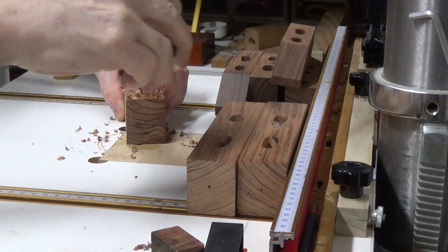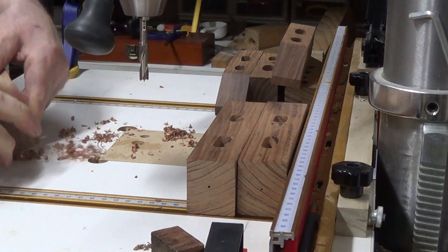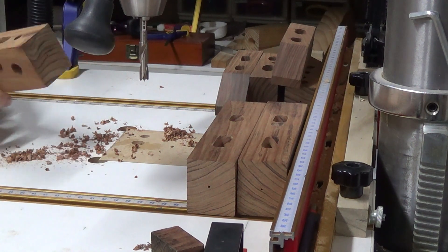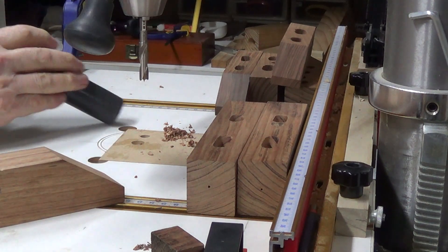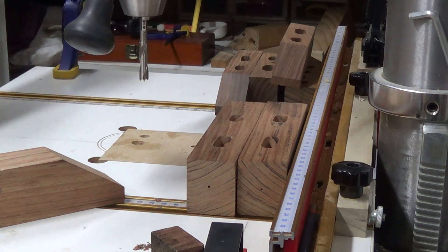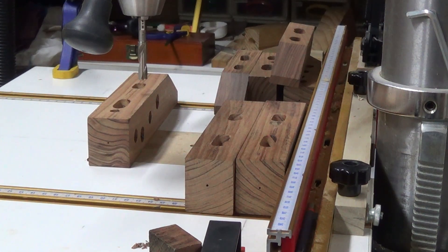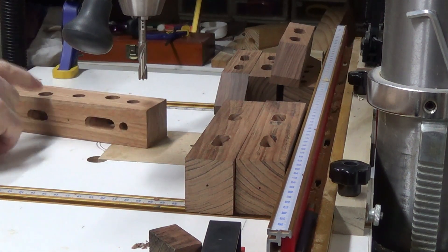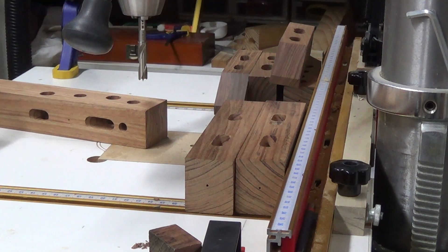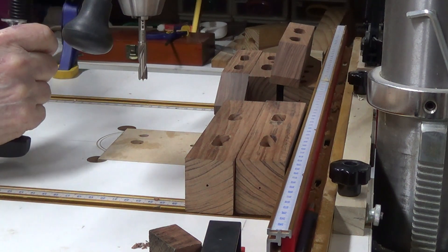As you can see, it just goes through it like butter. The only problem is — look at that, beautiful hole — I haven't actually mastered the dust extraction at the same time, so it's got to be manual. The holes I'm drilling in those two positions are actually 9mm, designed for these type of clamps, so they can be clamped down using those holes.